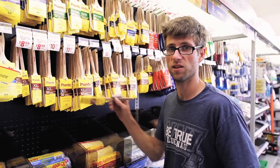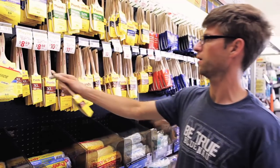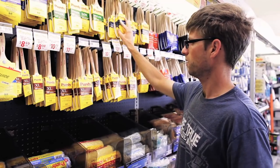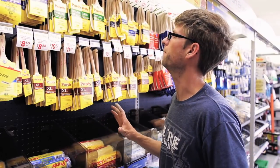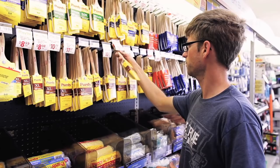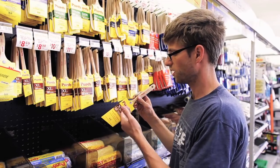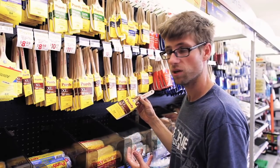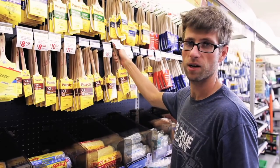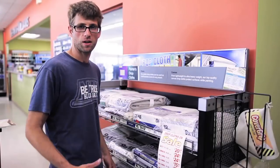This one says 'stiff' on it - the more rigid the brush is, the better for me, because I'm real abusive on brushes. As you're moving all over the wall, it's nice to have the bristles be as rigid as possible. I'd get the smallest one, a medium-sized one, and a two-and-a-half-inch for my biggest size. Just don't get the oil-base brushes. Read the label - as long as it says you can use it for latex paint, you're good.